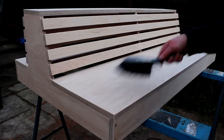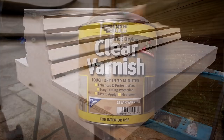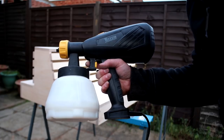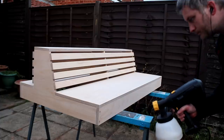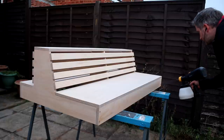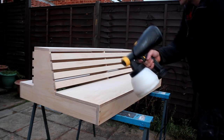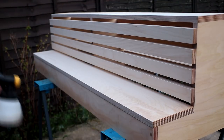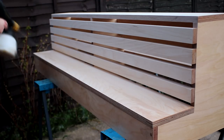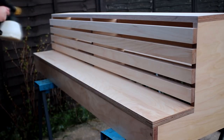I then brushed away all of the dust. I'm going to use water-based varnish for the finish because the client wanted the wood to be as light in colour as possible, and I'm using my new electric sprayer to apply it. I first watered down the finish by maybe 10% and then applied it in the direction of the grain. A lot of people have asked me about this sprayer — this is the first time I've used it properly on an actual project, so I'll make a video about it very soon.